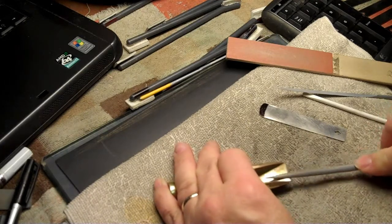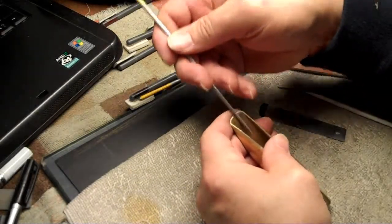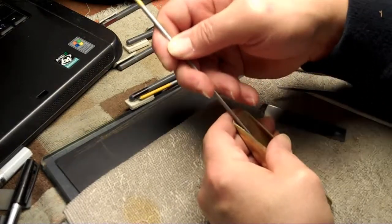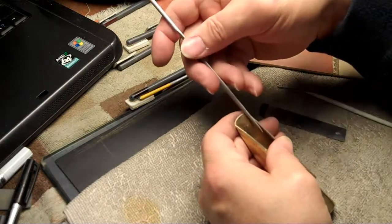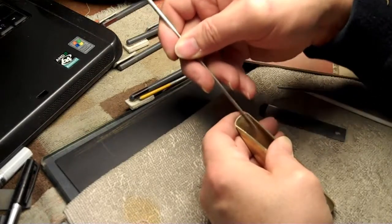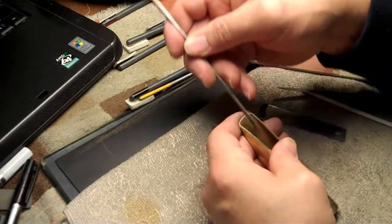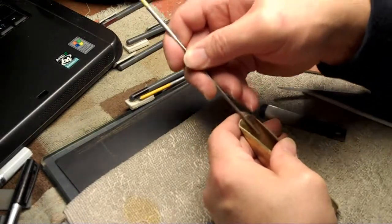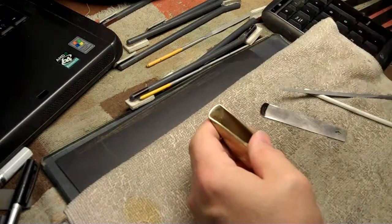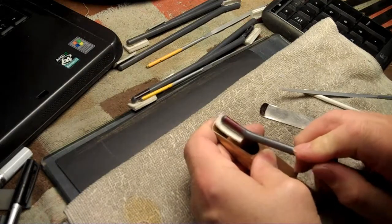Don't want to change the baffle — just kind of blend it back into where it was. What I'm going to do is make it all the same thickness as the thin spot. Then we'll take just a light pass when we're done on the sandpaper, and then I'll give it a little extra thickness. After that I like to switch to sanding sticks — use my coarse one.